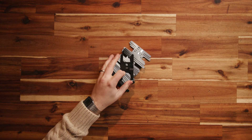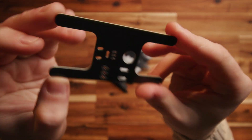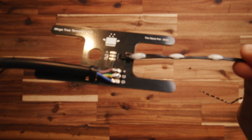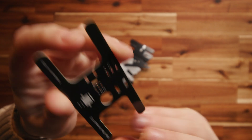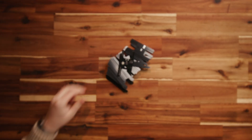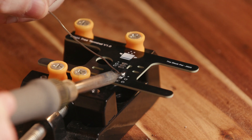We're going to start by soldering our terminal ports — the H-shaped PCBs that'll make up the bottom of our strings. The ones you receive in the kit or order from PCBWay will be slightly different from the ones I'm using here, but the instructions will remain the same. The terminal PCBs have solder points on the bottom of your string and another for your pigtail. The sides are labeled either input or output. If you haven't soldered PCB before, just place your soldering iron tip on the pad and feed solder into the joint slowly — the solder should flow onto the pad easily.